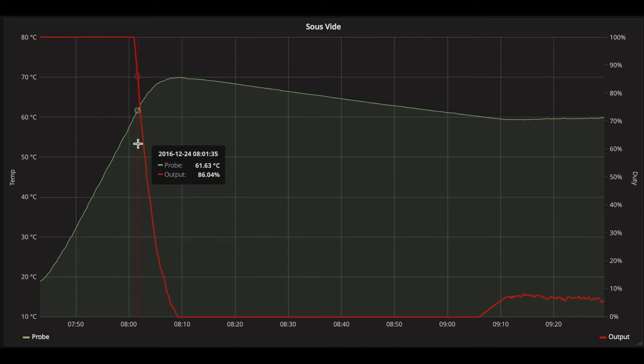But that didn't matter — it still overshot quite a lot, all the way to 70 degrees. Finally it shut off the element completely and the water cooled over the course of almost an hour before it was back to 60 degrees. Then the controller turned on the element a little bit to maintain that, and if left longer it would have eventually steadied out at exactly 60.